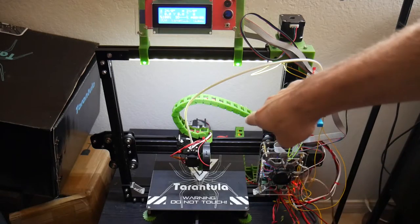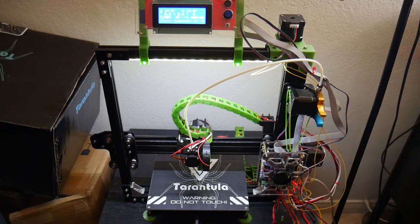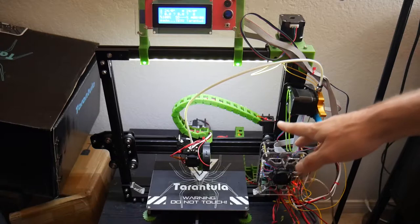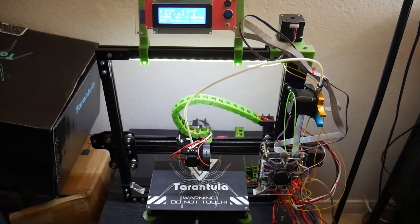My buddy says it reminds him of CNC machines — I guess he's seen CNC machines that use this kind of cable drag chain. I ended up having to put a little zip tie to connect the drag chain to its main base attachment right there because it kept popping off. I'm not sure if that was a print issue or maybe I printed the layers too high — I printed the chains at 0.2mm layer height, maybe I should have gone even thinner. But applying a tiny zip tie fixed that issue. I also had to print out this little corner bracket so the chain unit wouldn't hit anything as the machine moves up.